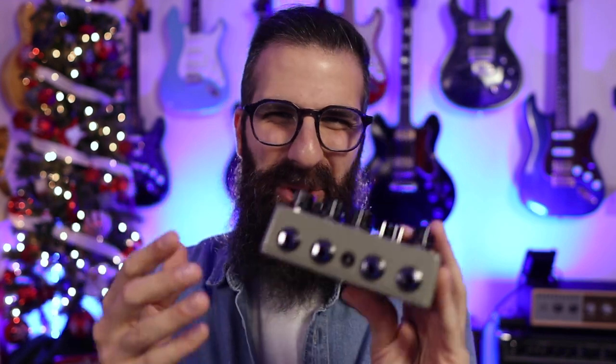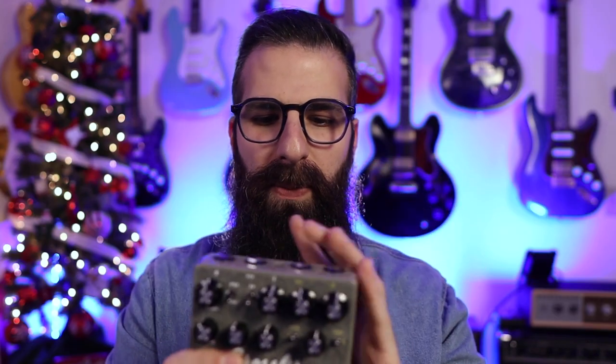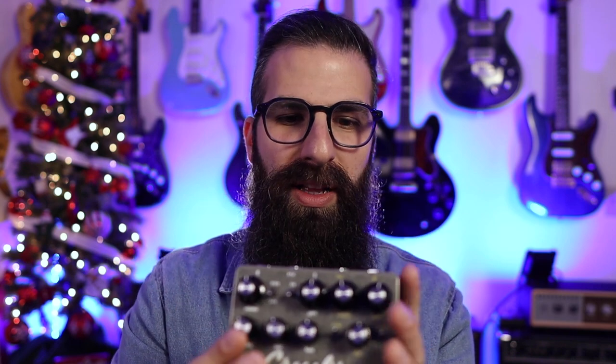That does it. On the back, we have, surprise, you are surprised. Now you're wondering, why are there four inputs or outputs, what is this? That is the question that you ask yourself. I'm here to answer these questions, okay? This is your input, this is your output. This pedal has a passive effects loop. So assume this is on a pedal board. Guitar goes in. Now from here, your effects loop, you can have another overdrive, modulation, univibe, whatever you want, in between your overdrive and the amp, all of that goes in between, and then you're out, and that's it.